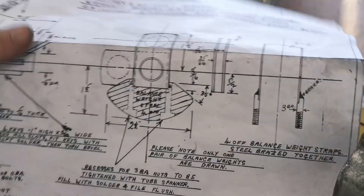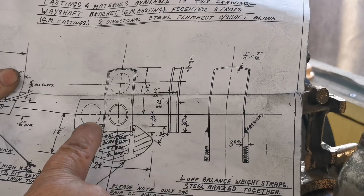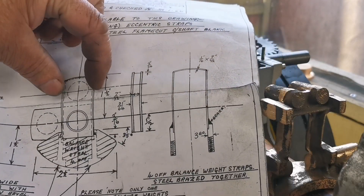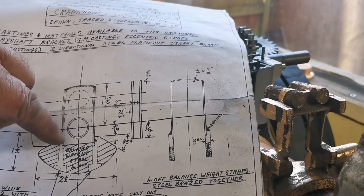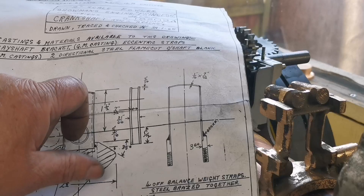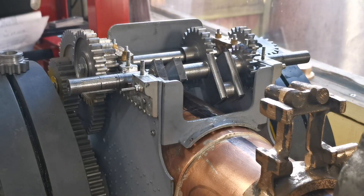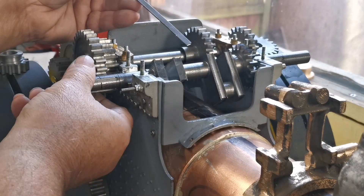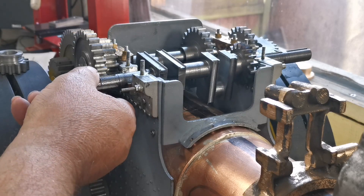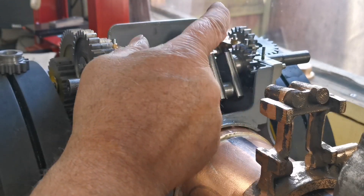Welcome back to my channel. I'm going to carry on and make these counterbalance weights for the crankshaft. I've got to make four of these weights and four of these straps. The straps fit over the crankshaft, the bolts go through the weights, and there's a counter bore so the nut will be within that inch and a half radius. They'll have been machined, filled, then machined. I've got a narrow strip which fits in the slot I cut for the straps, and also some flat stock I've already machined to the thickness of the cranks for the weights.